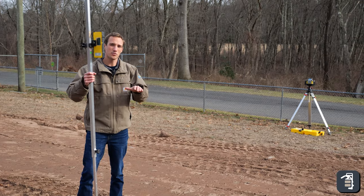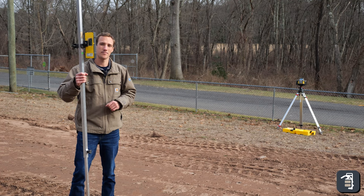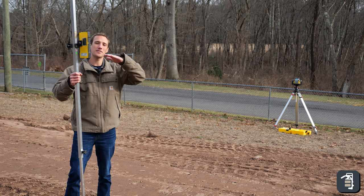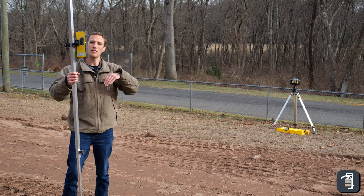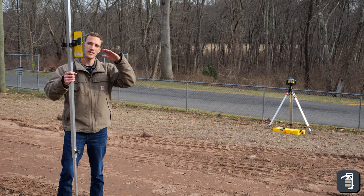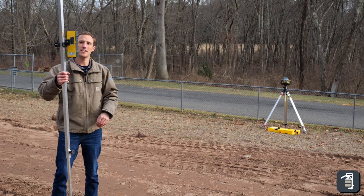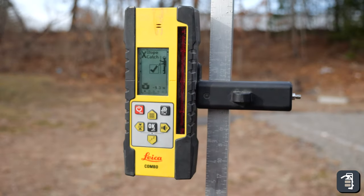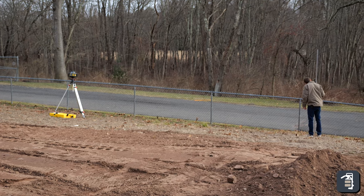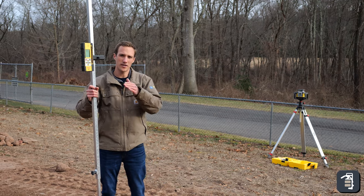The best thing about a dual slope laser on the job site is we're actually able to build the slope into the laser. What this means is no math for you on the job site. Right now, the laser is actually finding its slope by moving up and down, and we can actually hear it now that it's just rose above the laser receiver, and now it's gonna start dropping back down. Once it's beeping solid, it's then found its x-axis. There we go. Got it. So now we have our plane set up in the appropriate pitch because we got our x-axis,